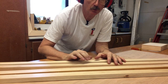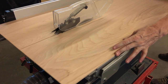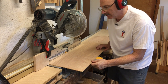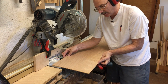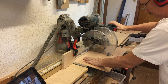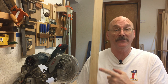Now we're ready to make the tops. I'm making three 12x12 panels, and I want to cut each of these tops to be slightly over 12 inches in both directions. I've already ripped it to be slightly over 12 inches this way, and now I've set this stop block to give me the same dimension on this axis. I'll cut everything to 13 inches, and that'll give me some leeway when I go to cut my miters.